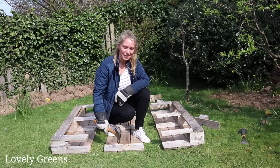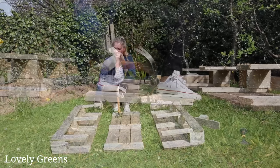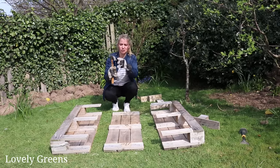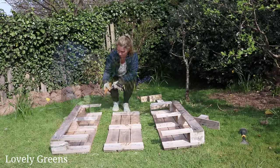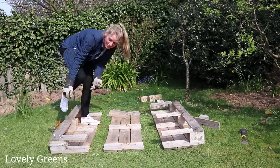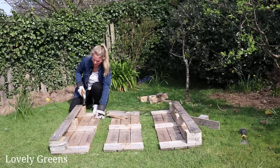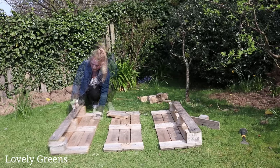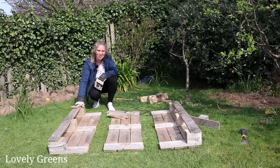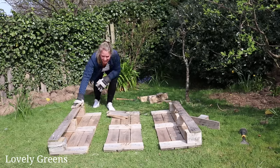The nails are necessary because they hold the whole piece together, so hammer them down — you won't see them in the final product. The smaller planks on either side can sometimes come off by wiggling, but more often you'll need to use the claws of a hammer to pull them up gently without splitting them. In the strawberry pallet planter I left these planks in, but taking them out makes it easier to fill the planter and gives you extra wood. I'll use the GTA 26 to cut them off.